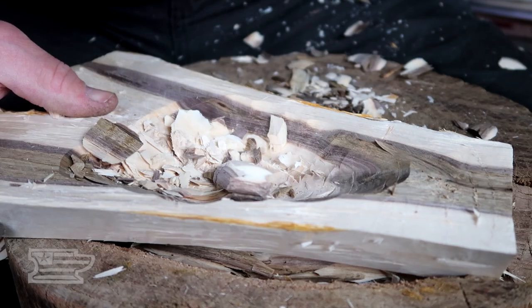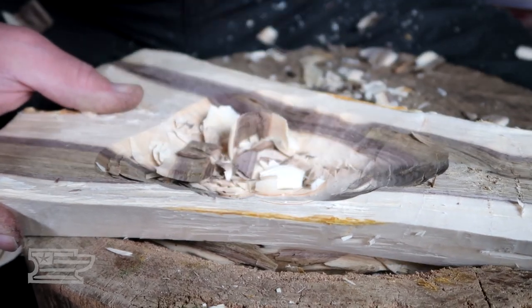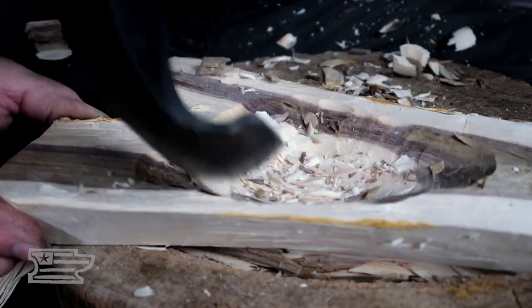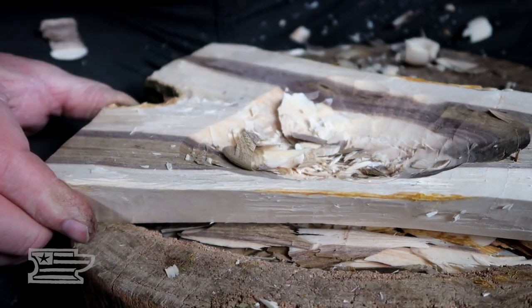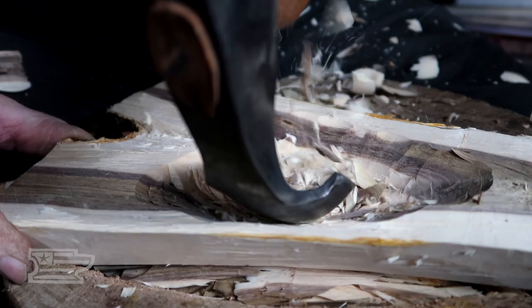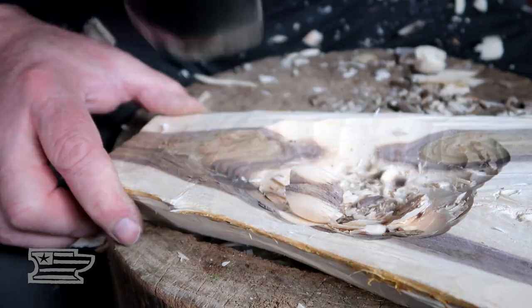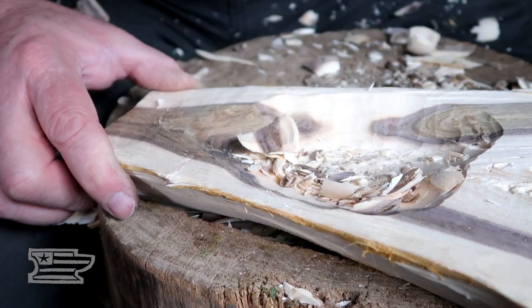Can't get that right quite like I'd like it to. It's irritating when you keep picking those up and they keep staying with you because they really mess your swing up. If your cutting edge doesn't cut, it skips and that's dangerous. While your tool's sharp and you kind of get a feel for what you're doing, it'll follow that wood and hook in there. But if you get a chip stuck, that can deflect the tool and it can skip at you.